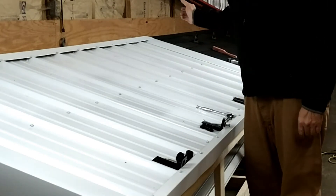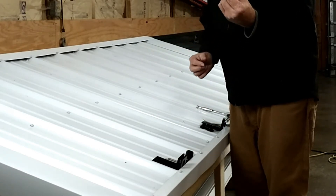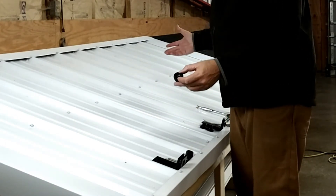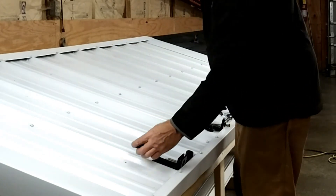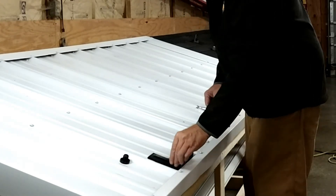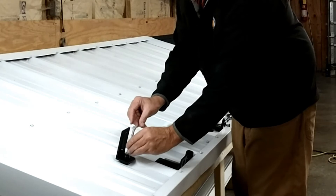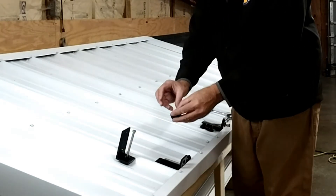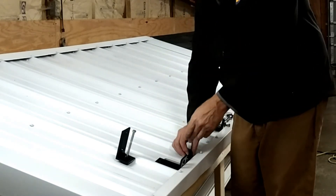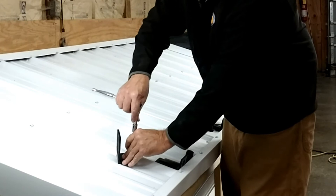Now that we've done the shingle portion of the roof, let me show you how the metal portion goes in. These systems are pretty simple. This is just the attachment location — I've pre-drilled all of the holes here to save some time. Now we're going to put this down. These will fit there, and then the footers will fit over top of them. The bolt goes down through that, and after that's all secure, this cap will fit over top and give a nice watertight seal. So let's go ahead and attach them.